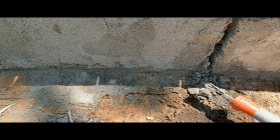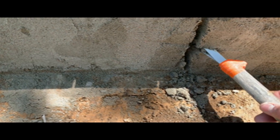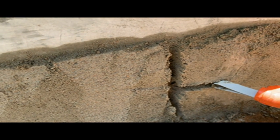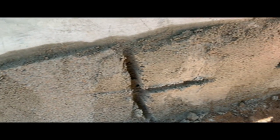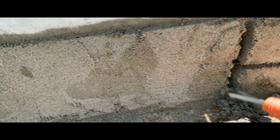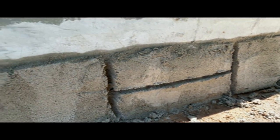Now, once you get these mortar lines cut in, I let it sit a little longer, and I go back over this with a dry brush. I've got this little brush right here. I usually use a little bigger one, but I'll use this today because my other ones are all used up. And you go back and brush these and soften these lines up, and it is amazing. Does a really, really good job. You don't have to go in super deep. I go in about a 1/2 inch or maybe a little more. And it turns out looking like rocks.